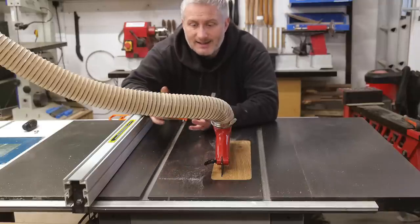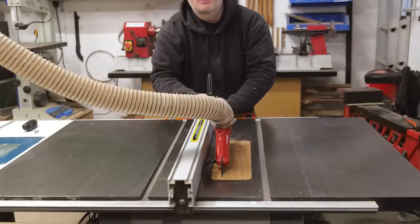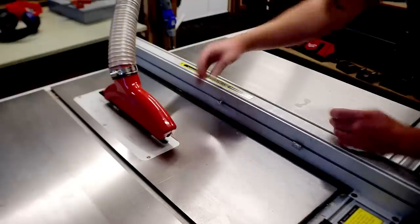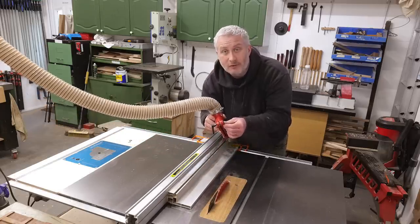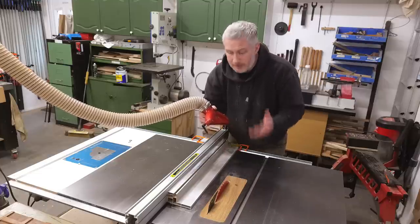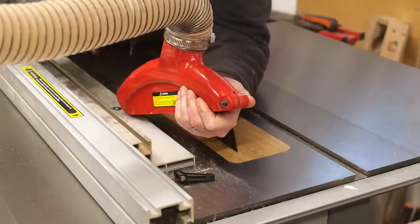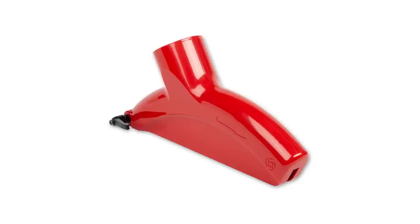The final issue is with making narrow rip cuts. As standard, the crown guard that comes with this saw — and many other Axminster saws — has a knob attached to the right-hand side which limits how close you can set the fence to the blade. The solution is to use the auxiliary fence that comes with the saw, but that means adding two knobs and bolts, and I can never find those bolts — they always seem to go missing. You might think the solution would be easy by taking the pin out and rotating it 180 degrees, but there's a slight offset with the flat area on the pin which the crown guard is designed to pivot on — in other words they've deliberately designed this so it can only be fitted with the knob on the right. Perhaps more evidence that the people who design tools don't seem to use them. I previously made a slight improvement by removing the knob and adding a regular washer and wing nut, which allowed me to get the fence a little bit closer. But when I searched online for crown guards I found the same one but marketed with the knob on the left-hand side, so I ordered one.